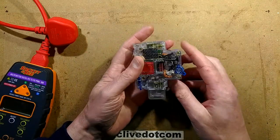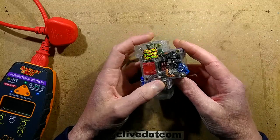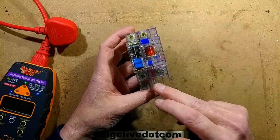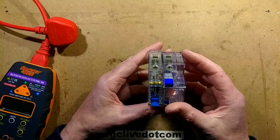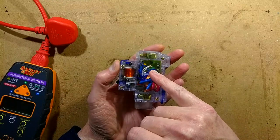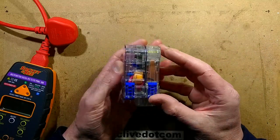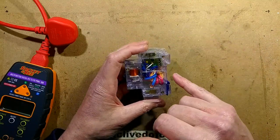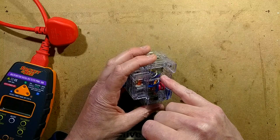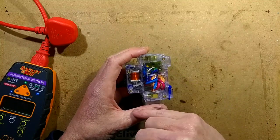This one is really interesting because it's a standard circuit breaker — well, I say standard, it's transparent, which is not standard. It's got an RCD trip mechanism in the side, and basically speaking the power loops through this breaker, comes back up and goes through the mechanism. The circuit board in here is really sparse — there's so little in it. I can see four diodes possibly forming a bridge, some capacitors and other support components, and a heavy-ish resistor which might be a power supply resistor.